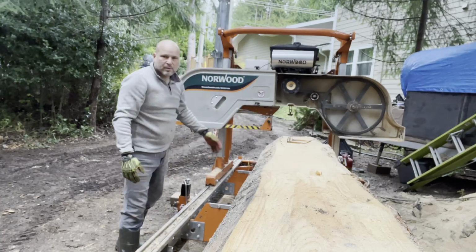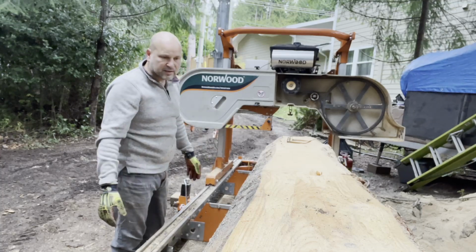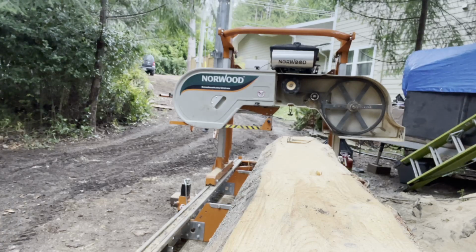You know, next spring when we bring the mill back up online, it'll be time to go over all these bolts, just check them for tightness and missing bolts. Loctite them, I suppose, wouldn't be terrible. It's a lot of vibration.